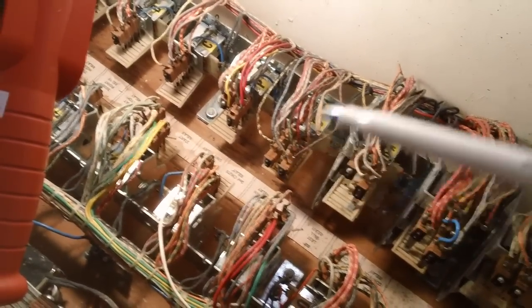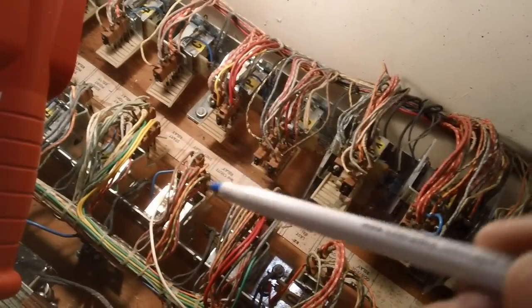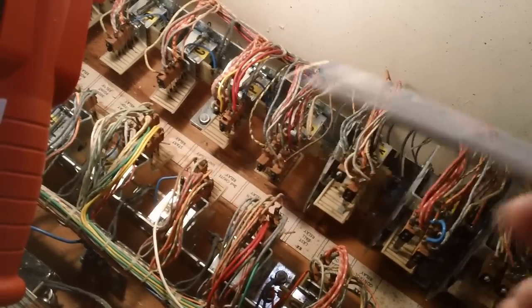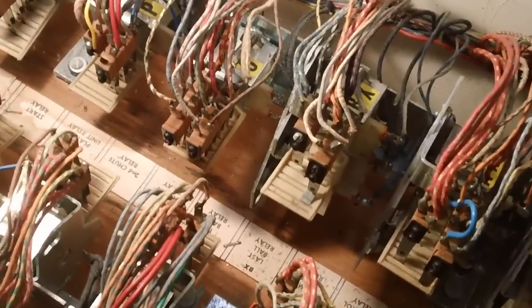I see what's happening now. The question is: how do you get a whole bunch of contacts to operate off of a single relay, especially if some contacts have to be closed and some have to be open, and when you activate the relay they have to change positions? Well, you take these little white plastic things and make the tips of the contacts really long, slip them down in these slots, and depending on where each sits in the slot determines whether that set of contacts is open or closed. When the relay is energized it makes this thing go in and out, causing the contacts to change.